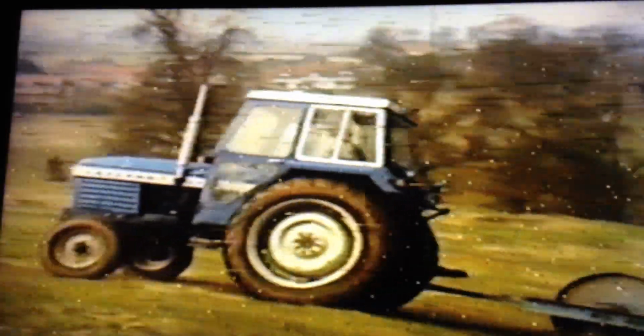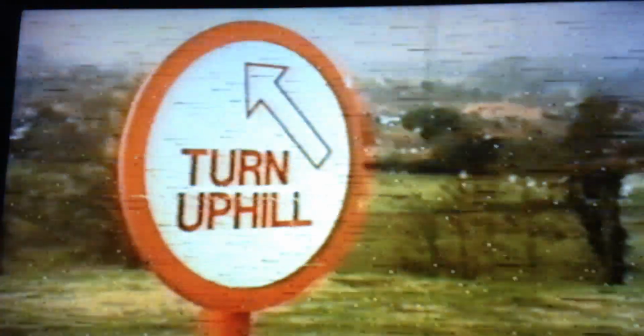Safely crossing a 1 in 6 slope towing a 2-ton roller. Very little of the equipment weight is passed onto the tractor's rear wheels. So on gradients, the one thing you must never do is turn into a descent. But normally, there is nothing there to remind you.